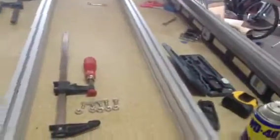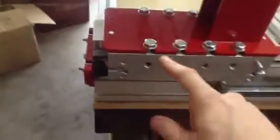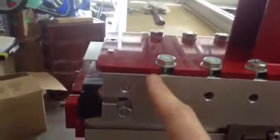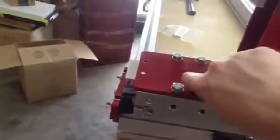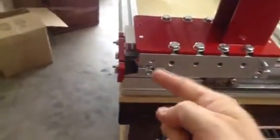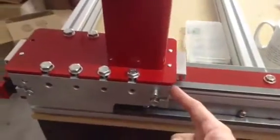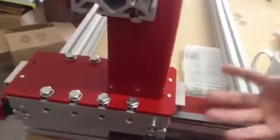Here's the last variable — and this is actually one of the first things you should do. Realize that when you attach this gantry riser to the rails, there's a tiny gap where this gantry riser can sit an eighth of an inch forward or an eighth of an inch back from this bolt hole. If your gap is off by an eighth of an inch when you originally temp install it, what you do is clamp the sides, loosen up all your bolts, and use a small rubber-face mallet to tap, tap, tap — push that thing forward. Make sure both of them are pushed forward, and that should fix any alignment issues.